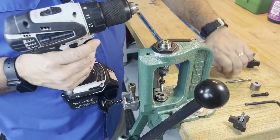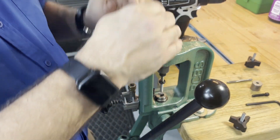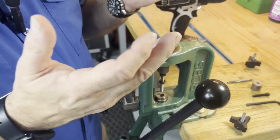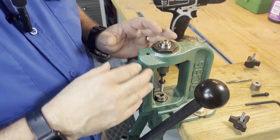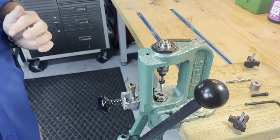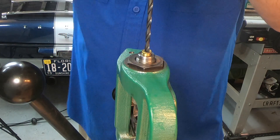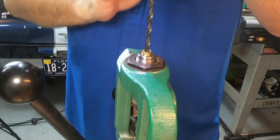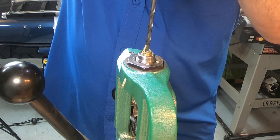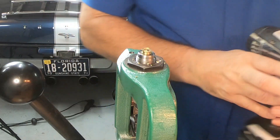The next thing we want to do is drill and tap. I'm simply going to take the drill bit they sent me — this number seven is what it is — and line that up as straight as possible and drill through. If I'm off a little bit, as long as it's not extreme, it just won't matter. Using a drill press isn't required; we don't need that level of precision. Eyeball it, get it as close as you can, and that will be good enough. I line that up with the primer pocket — this is a large primer pocket, so it actually fits and creates kind of a guide for me. With a small primer pocket I've got to work a little harder to keep it centered, but it's actually pretty straightforward. Use fairly low speed — there's no reeling, it's very soft metal. And that hard bite is the last little bit of brass I needed to get out. My hole's made.